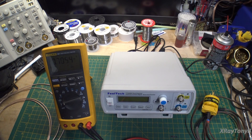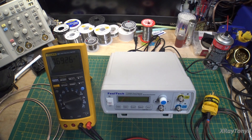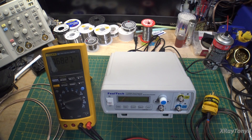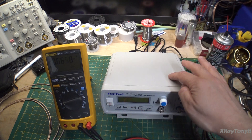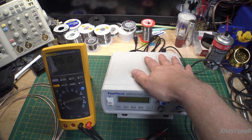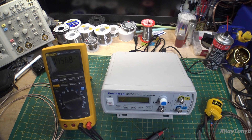What can we do about that? There are a few things. You can connect this to its own isolation transformer. Better yet, you could remove the switch mode power supply and replace it with a linear power supply that uses a traditional transformer, a bridge rectifier, a capacitor, and a linear voltage regulator — and then you have total isolation. You can put a three-prong cord on there, put the ground prong to ground and reference it to the output terminals, or leave it floating. A less safe option: there is a safety capacitor in there that's most likely causing that leakage current. If you remove that it would fix the issue, but at the expense of safety and surge protection — not a good idea.